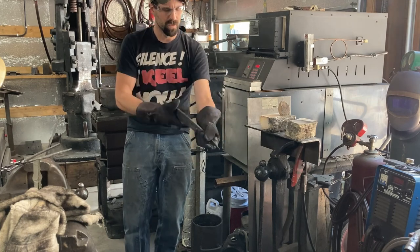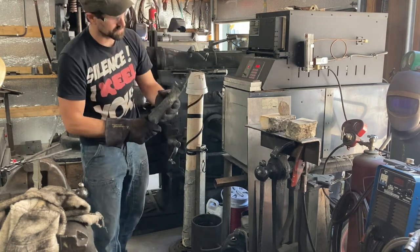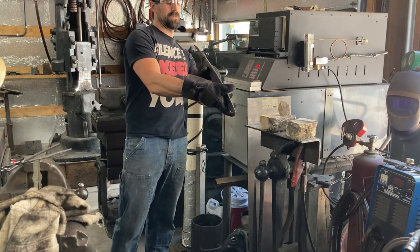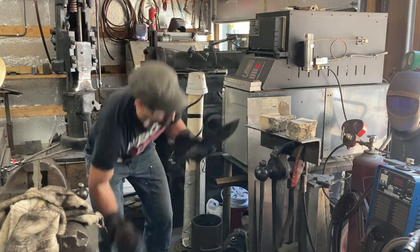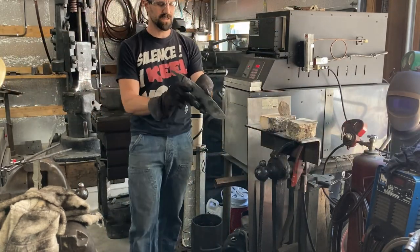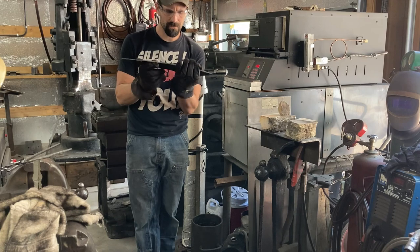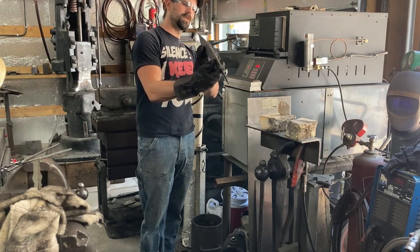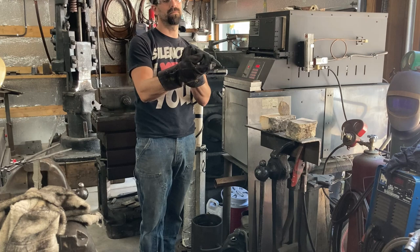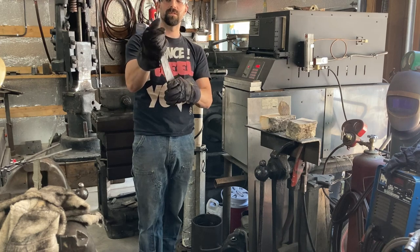Glove straightening. Pretty damn hot even through the glove. Check the tang alignment from both sides. Looks good there. And it doesn't have to be perfect. It has to be visually good from a quick inspection and straighten like this for now. You know, no major warps or issues. But then after temper, we have tricks that we can use to straighten it as need be, should anything arise.